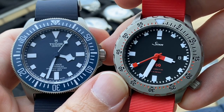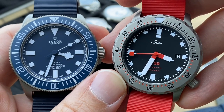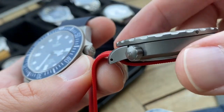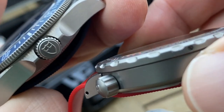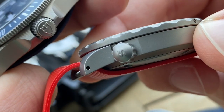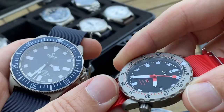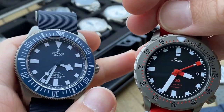And a way that watchmakers manage to get fatter margins. I'll give a few examples about this. Again, titanium, even grade 2, is a great alloy. It's 40% or 45% lighter than 904L or 316L, but it's 20% softer. But it means that the weight to strength ratio is higher on titanium.